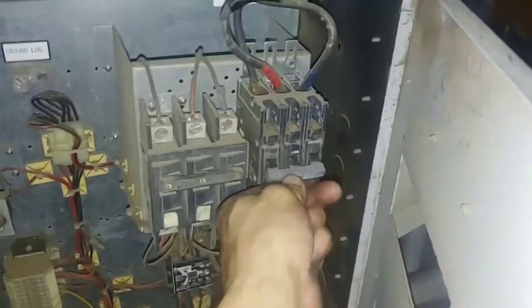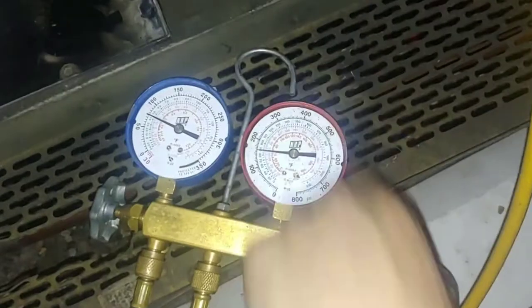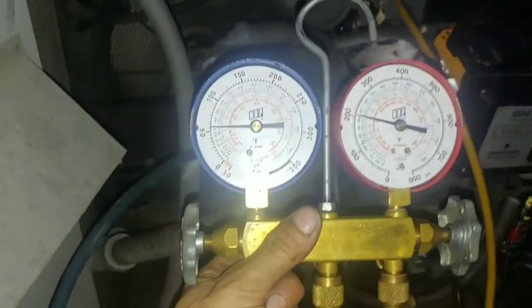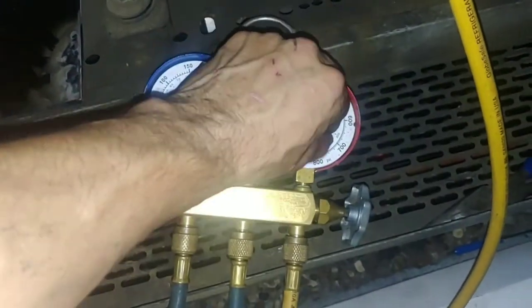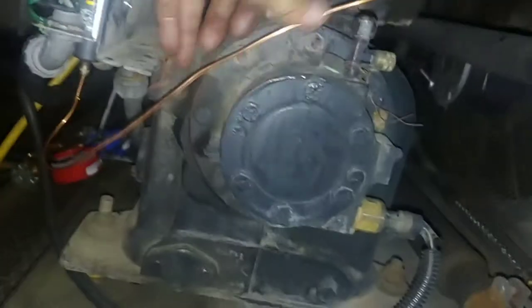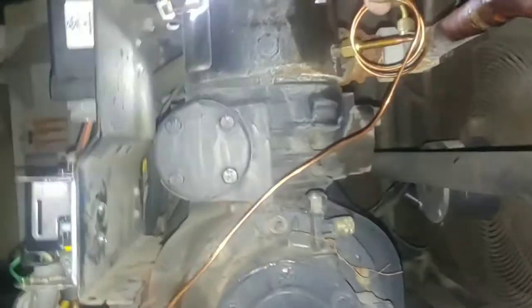All right, here we go. Back on — yes, I know I need new gauges, thank you. So that's that. I'll check this off camera, but make sure that this copper tubing is not rubbing against anything — don't lean it on anything, make sure it's free the entire way. Or it will rub, create a leak, and then you'll lose all the refrigerant in the system. Don't do that.